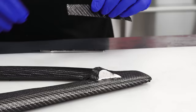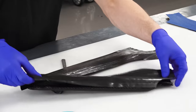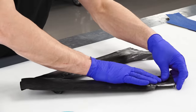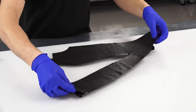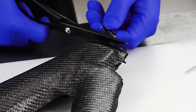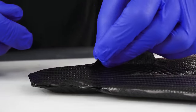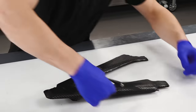More complex geometries can be accommodated using cuts and overlapping sections. Layers of unidirectional reinforcement are now used to add the majority of the strength to the component in the direction that it's needed, before the final layer of woven 210g is used for the outer surface. It is very common to see unidirectional fibres sandwiched with woven cloth like this — unidirectionals are prone to splitting or splintering if used on the outer plies, so woven fabric helps to keep those unidirectionals protected and properly bound together.